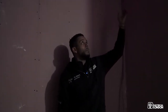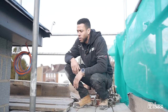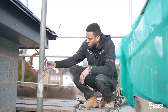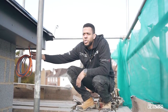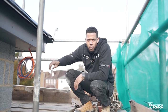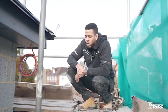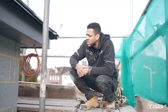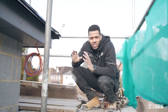In some areas we've left the cables out ready to be plastered. Once the walls are plastered we can get the cables into the correct position. This is going to be an access point going into the wardrobes here to serve this floor. Up in the soffits we've already pulled through some cables — two orange Cat6 cables for our cameras, and a blue Cat6 just in case they pull the BT line in here, so we can join onto that and take our services down to the rack.